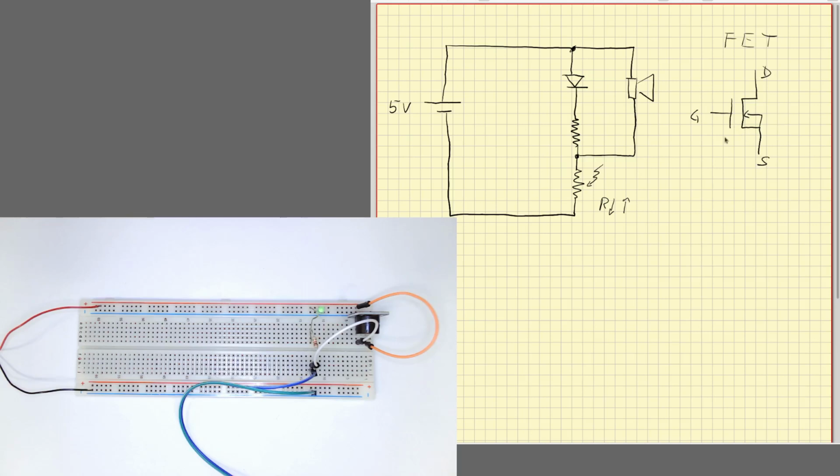And basically the operation of this transistor is that when I put a high voltage, a positive voltage in the gate, it makes current, a large current, flow from drain to source. It's like a closed switch, okay, like a closed circuit. But if the gate is kept at a low voltage, then it will not drive any current, okay? So our trick will be something like this.